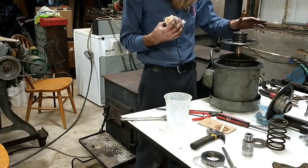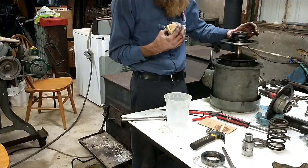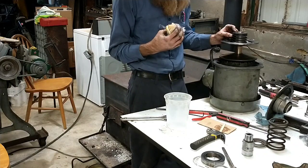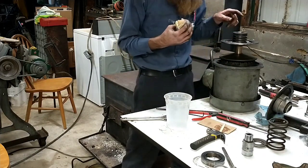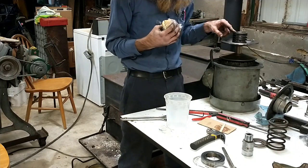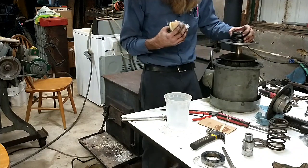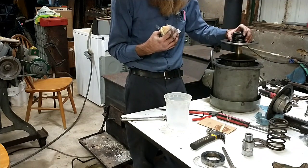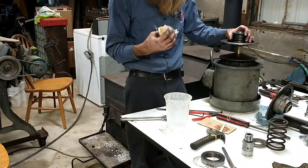Anyway, that's about it. Oh, one other thing. On this pulley, if you do the bushings in this one, when you put that key back in, do yourself a favor and Loctite the living daylights out of that little screw that holds that key in. Especially if you're doing power tapping, it likes to jar and rattle and loosen that screw up. And once it does, all hell unleashes itself in there, and you will probably wreck a motor pulley and who knows, maybe even the motor shaft.